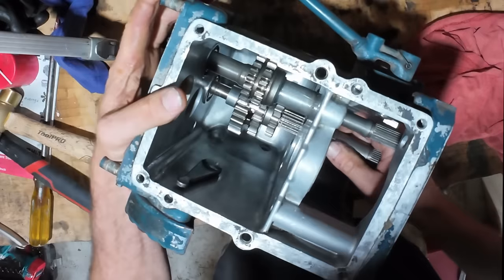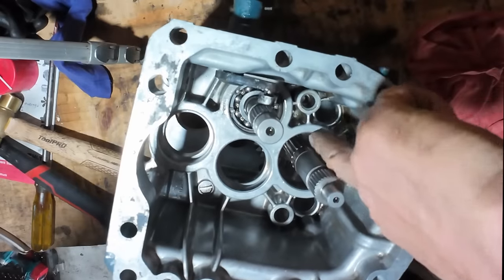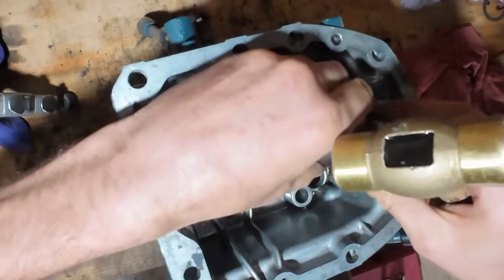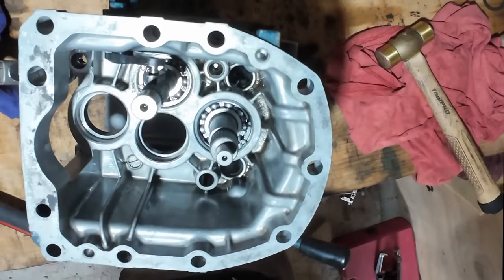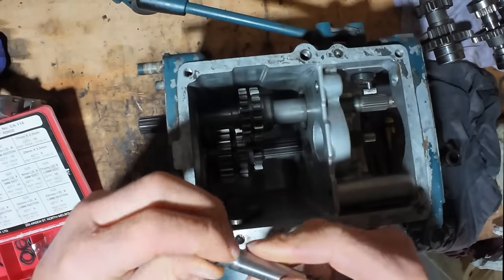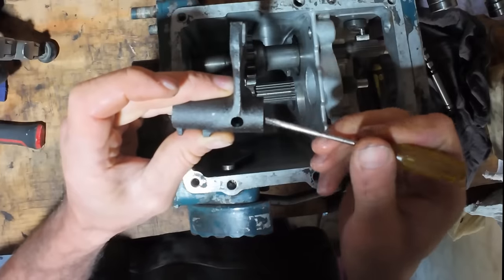And into the bearing. Circlip in there as well. Replace the O-ring, it's cut up. So I've got some grease on the ball bearing just so it stays on that spring, hopefully. Should make it stick in there.